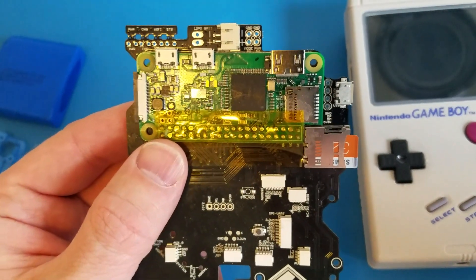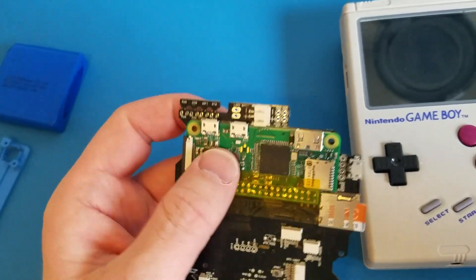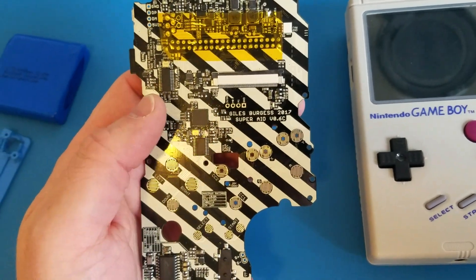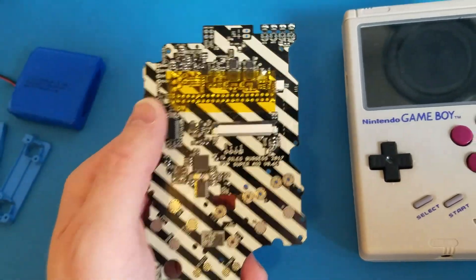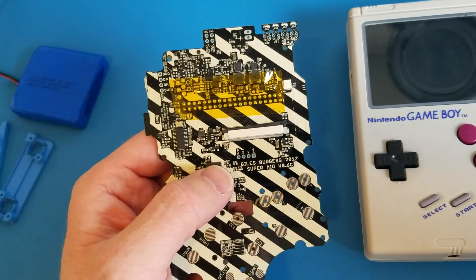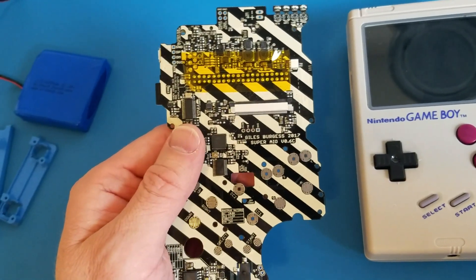The first step is you solder your Raspberry Pi Zero onto the board — you can see I'm building another one here, so this is already done. It relocates the SD card right there. You've got your battery connector here, some status LEDs up top. On the back side, you've got your audio amplifier chip. It has a USB hub built in. This has all the charging and power boost circuitry and a safe shutdown, so that way when you flip the power switch off, it takes a few seconds and does an actual safe shutdown on Linux.